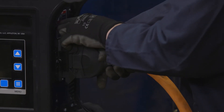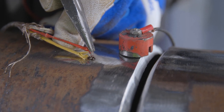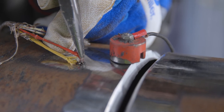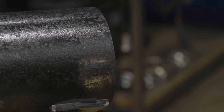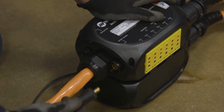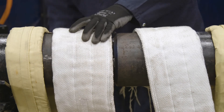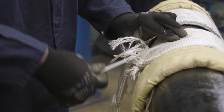Connect the ArcReach Heater extension cable with series adapter to the ArcReach Heater. Apply welded thermocouple, or TC, if they are being used. Attach the insulation fault detection magnet to the pipe, then attach the other end of the magnet cable to the TC extension box.